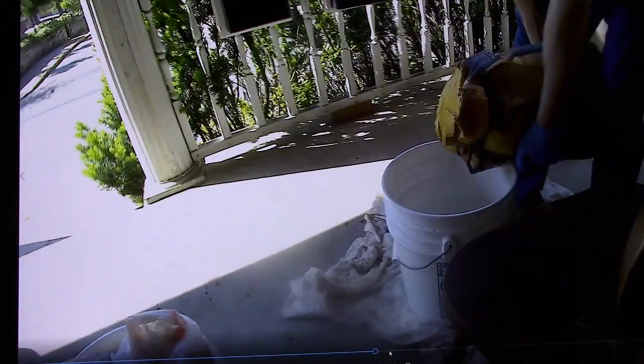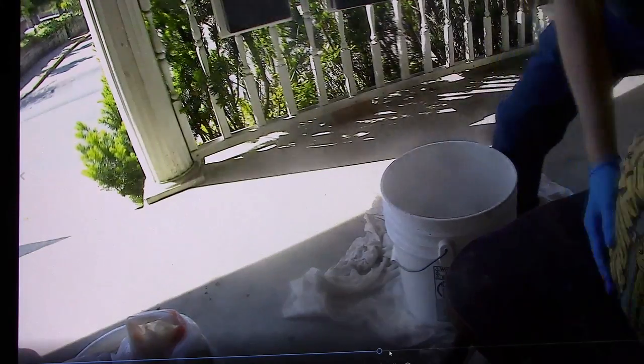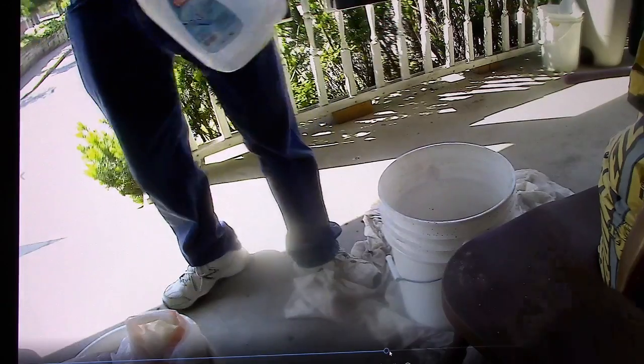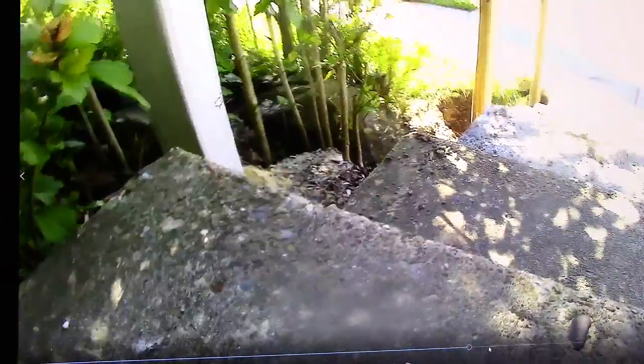Now when you're mixing concrete — it was a very windy day — I should have used goggles, maybe some eye protection, maybe even a mask so I wasn't breathing this stuff in. When you add your water, you want a consistency where it's not like putty, but you also want it so that when you draw a line with the trowel, the line doesn't just disappear. See — I'm drawing a line and the line kind of stays there. That's about the right consistency. Not an exact science.